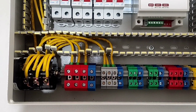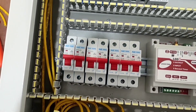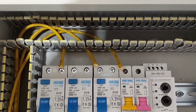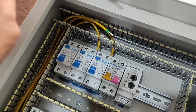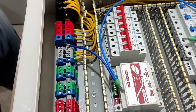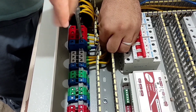Now we connect the emergency power and city power wires to the terminals. City electricity enters from the red terminals and emergency electricity enters the switchboard from the gray terminals. These three phases enter the electrical panel. At this step we connect the null wire to the city electrical terminals, emergency electrical terminals, and to the electrical panel.